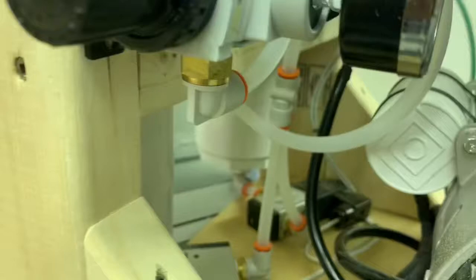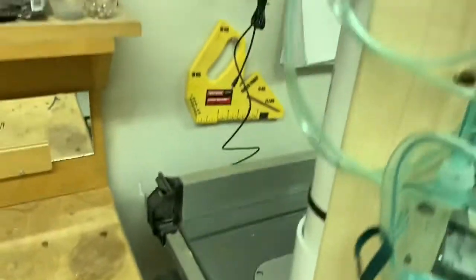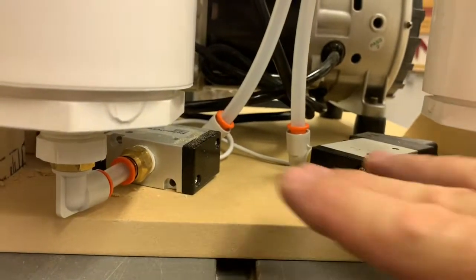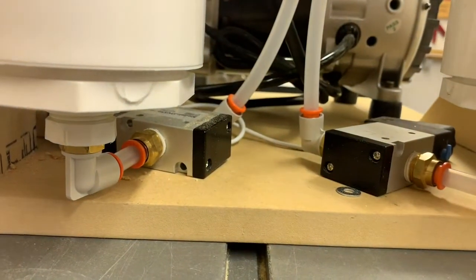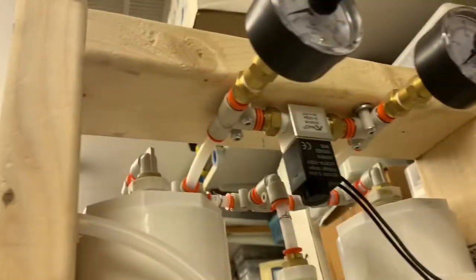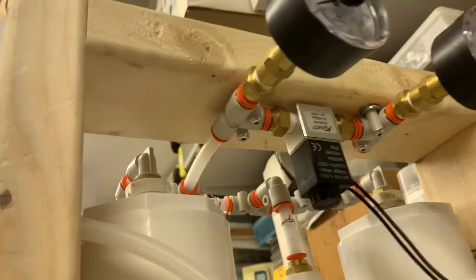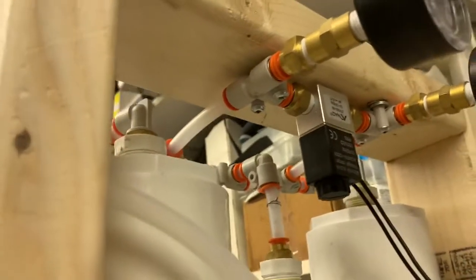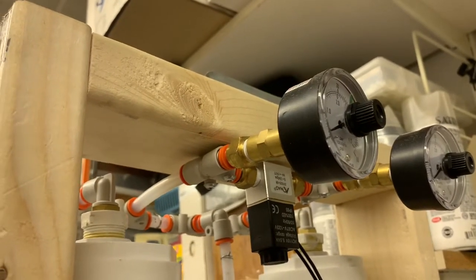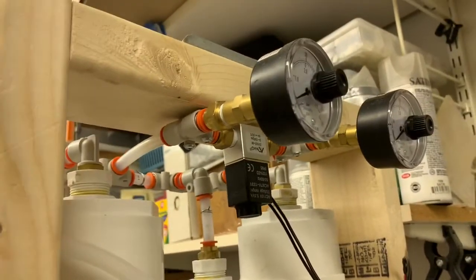We go out of that down into a Y adapter, which hits the two sieve valves. Rotating the machine — from those valves, we actually go into each sieve. These are the valves that pressurize the sieve and discharge the nitrogen from the bottom of the sieve. At the other end of the sieve, we're collecting the oxygen. There's another valve up here — this is a direct-acting valve, meaning it does not require air assist and operates either direction. That function is to be the pre-charge valve, which allows one sieve to pre-charge the other as pressure is coming up.